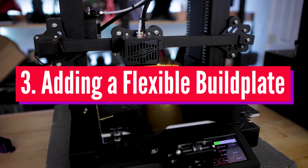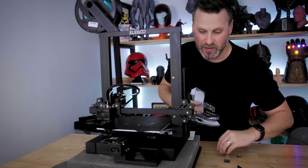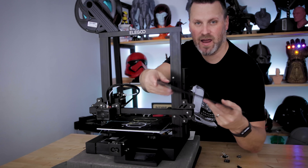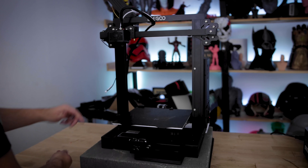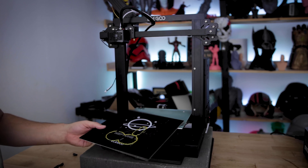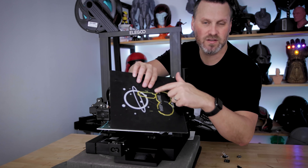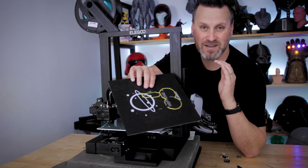The next one I want to talk about is the build plate. I have on here a generic flex plate. This is something you can find off of Amazon or other sites — it's a flexible build plate that you can add on to pretty much any FDM 3D printer, and I've added one here to the Neptune 2. The Neptune does have a removable build plate that it comes with. It's a great build plate with a build-tack-like surface on it — super grippy. As you can see here, I have some previous prints I'm still having a little trouble getting off of it. It adheres really, really well.